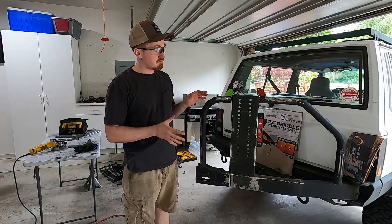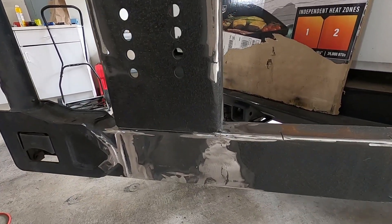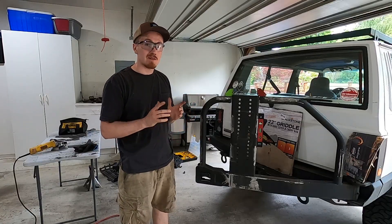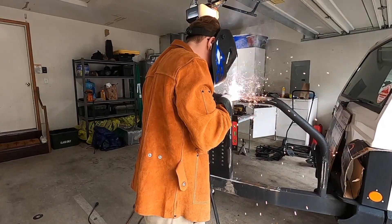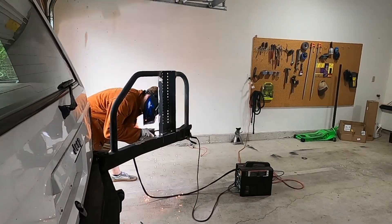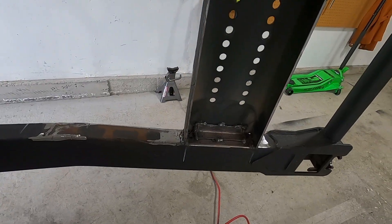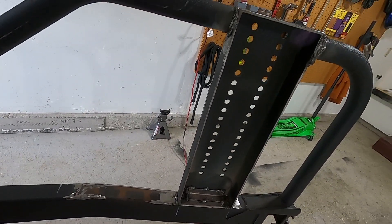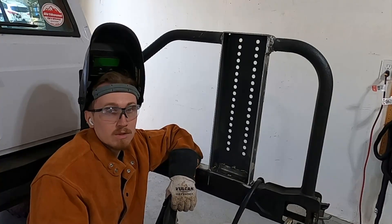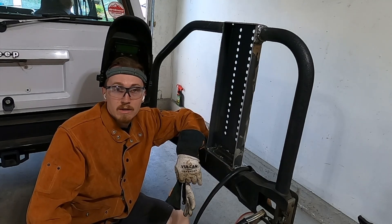We got it chopped up, kind of jerry-rigged it in place. We are cutting a lot of the support structure out, a lot of weight and steel. Part of that is for weight, part of that is so we can tuck it in closer. I'm probably going to be adding a couple of gussets and some scrap metal pieces here and there, just to try and stiffen it back up and give it that rigidity that we took away. As you can see, we've added just a little bit of reinforcement - a little 90-degree bracket - because we did thin this out a whole lot and there will be a lot of stress added. Adding a little reinforcement isn't going to hurt and we're still going to be losing a lot of weight from all the stuff we've cut off. I'm not going to waste your time showing you how I'm cleaning up all these welds - you know what a grinder is. Then we'll move on to painting.